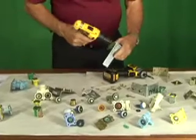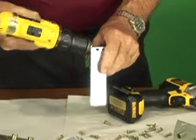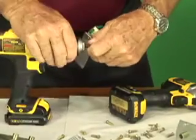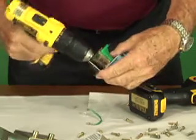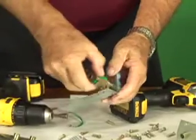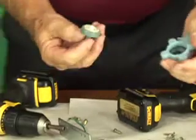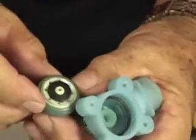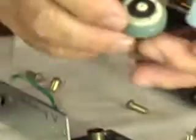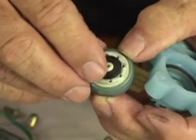We'll open one last valve to conclude this. Again, it's important to understand that no knowledge is available until you approach this disassembly process. If you don't approach a disassembly process, then you're virtually not going to know what caused your failure. We'll remove the coil. This particular valve housing, you can see the seat was loose in there, and there's some pretty good distortion around the edge of that particular seat. This definitely would be one where each time it seated itself, this washer could move. Leak, not leak, leak, leak, not leak.